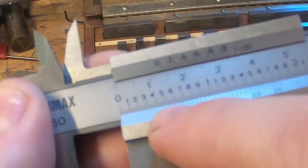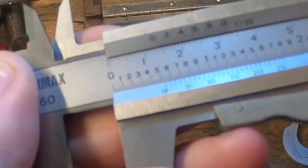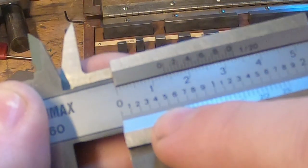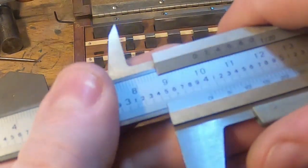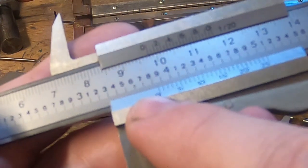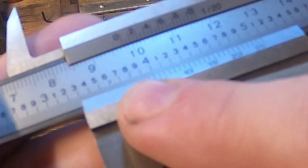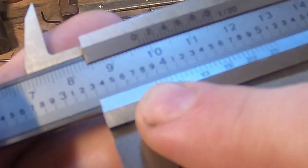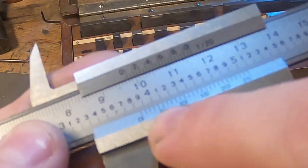If we do it again, we know we're past 500 and past the 25, so if we add whichever number lines up onto 525 that will give us exactly the dimension. So 525 plus which one lines up. If we measure up here we're at three inches, 800 there — and it's 850, and we're just a fraction after — so 500: three inches, eight hundred and fifty-one thousandths of an inch.